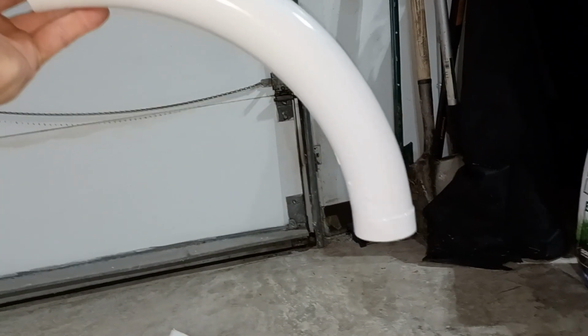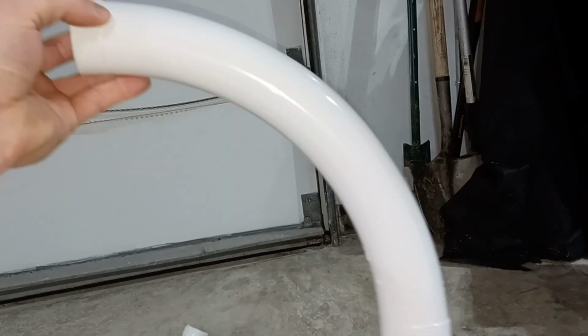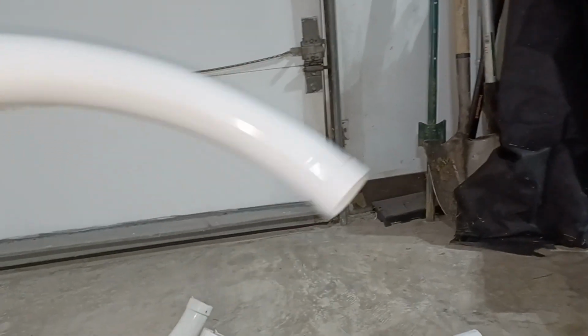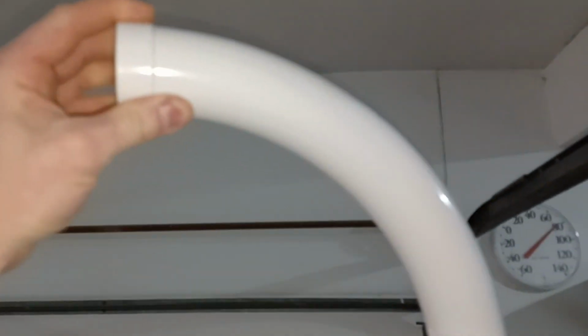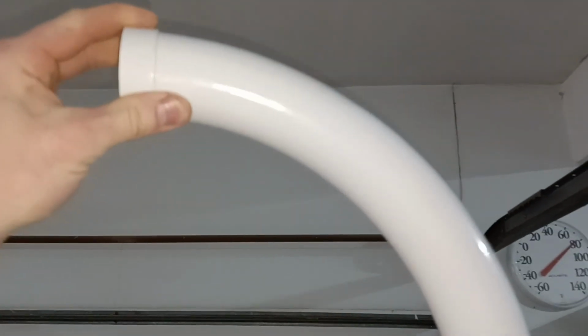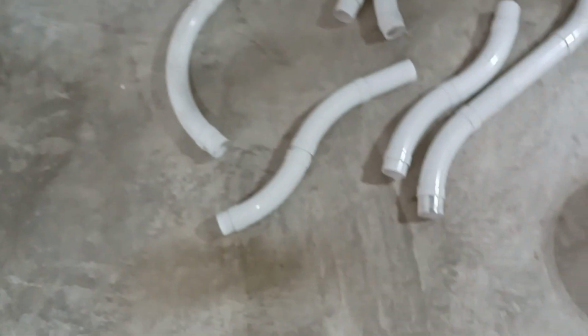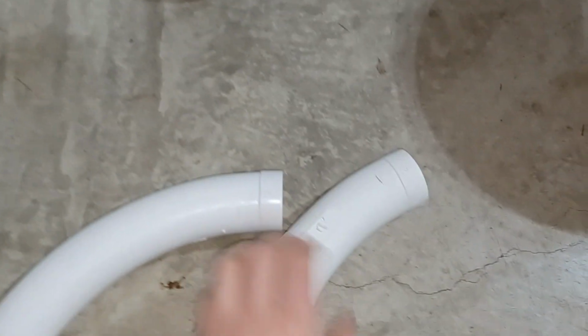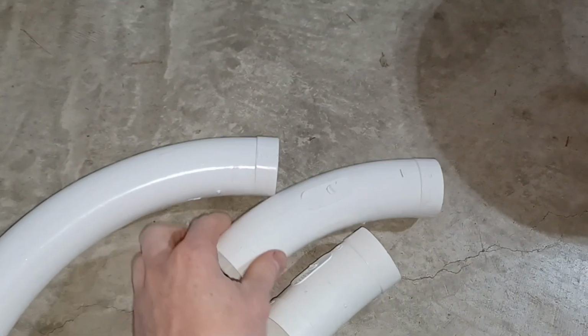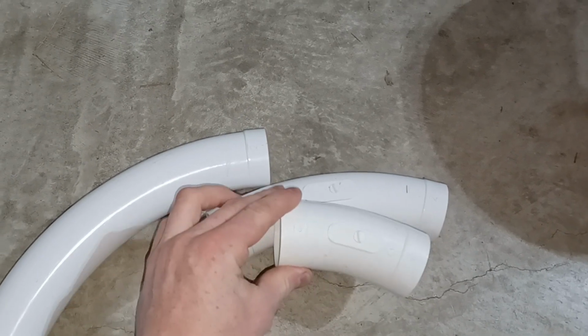One at the top of the pipe coming up or down from the wall inlet, and then we try to do 3 more or less in the raceway itself, and ideally all on the same plane. Whatever height the top of your wall is in your ceiling, you want everything to be at one height. Now, of course, you can deviate. The installation still has to conform to the structure, so we use these smaller offsets. These are 45 degrees. These are 22s.